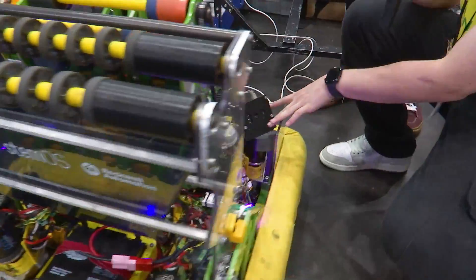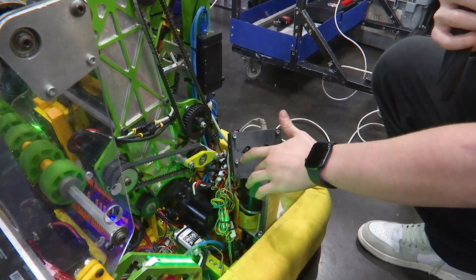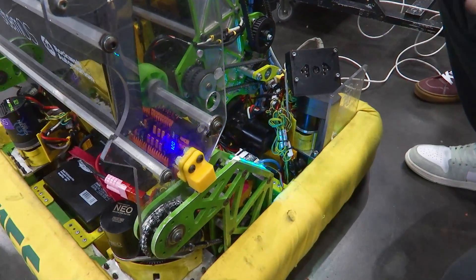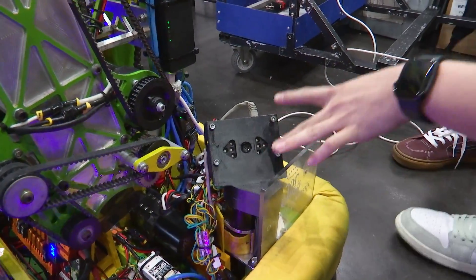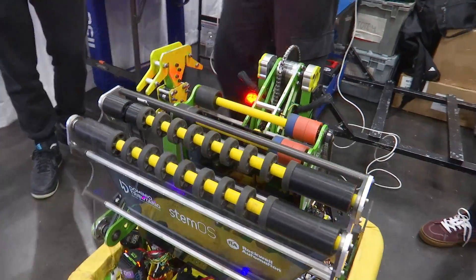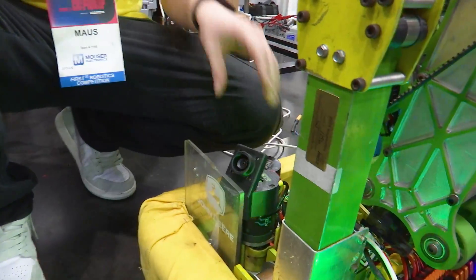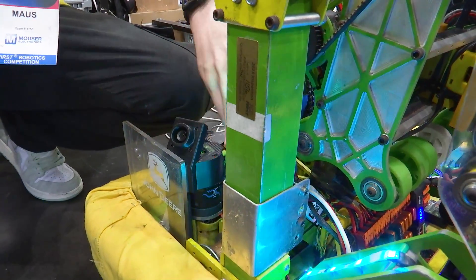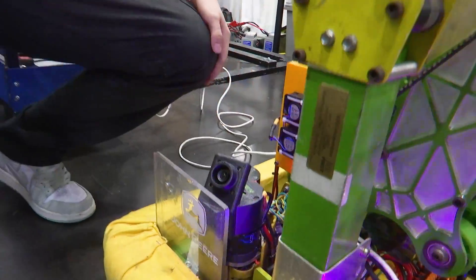You can see right here we have the Limelight 2 Plus supported by 3D printed parts. We did a 2D FOV analysis - we took the horizontal field of view of this camera, put it in CAD, and found the best position for it. We did the same thing with another camera, the ArduCam, to find the best CAD position so it can see the AprilTags. We are also using a radio in the tower.